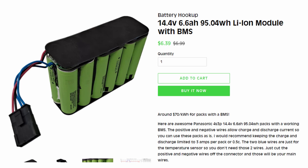They're going to have good name-brand Panasonic cells. The other advantage of these medical packs, besides being trustworthy components, is that they tend to not get cycled a lot because they're used in backup medical equipment. They just sit fully charged, and at some point they have to cycle them out due to age, but the capacity can still be full or almost full.